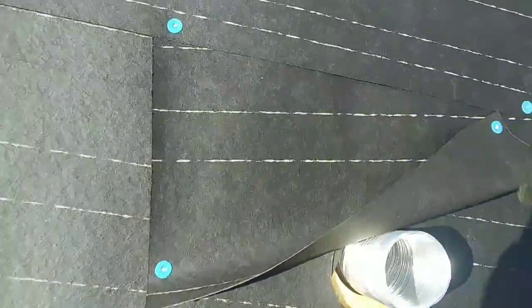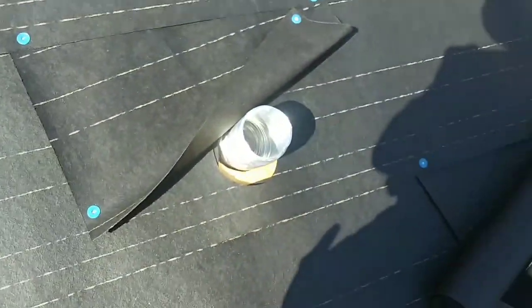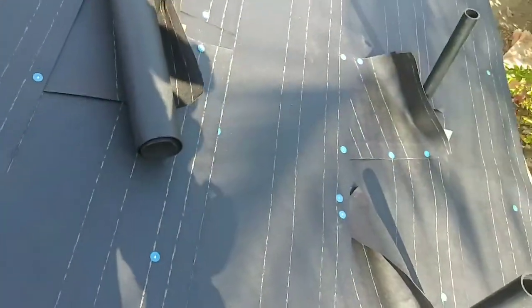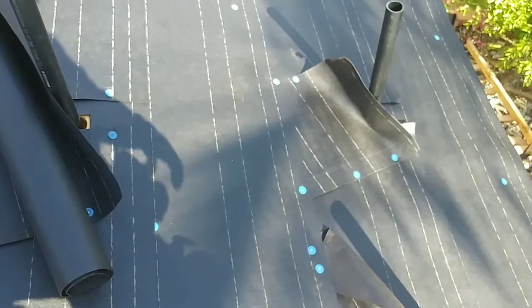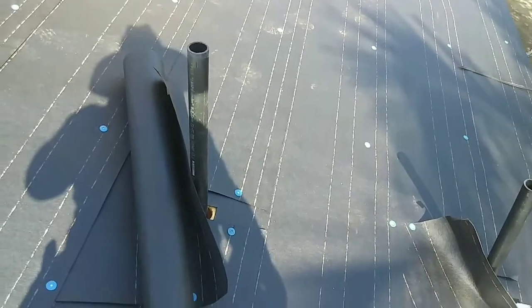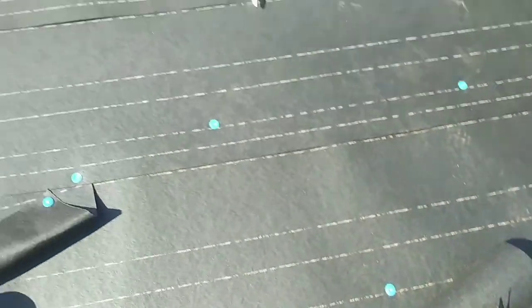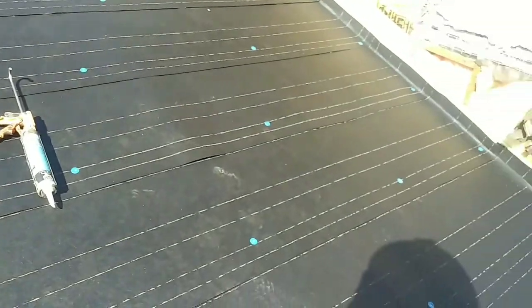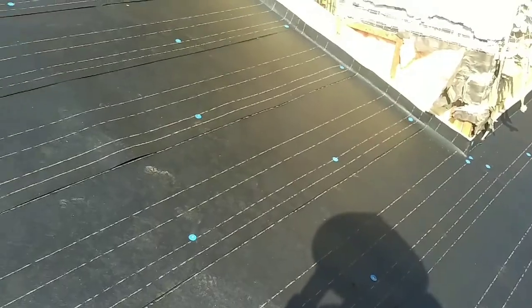So when the water hits, it's gonna drip over here, so it's not gonna go inside the hole. A little bit of water is gonna go eventually, but not much, okay? Most of the water is just gonna run off the paper and run down. When I come back, I'm gonna install the primary flashing underneath. Nobody told me about it. This is my first time here, so that's why I didn't bring it. But anyway, today I'm gonna show you how to do the Z-bar, right?